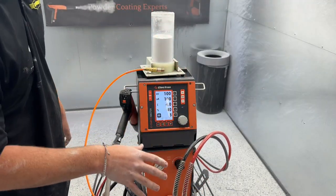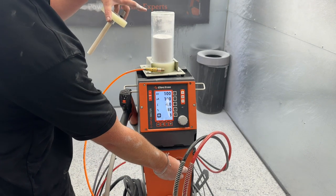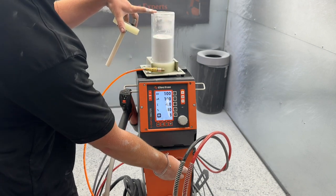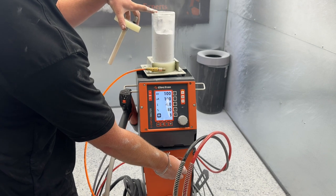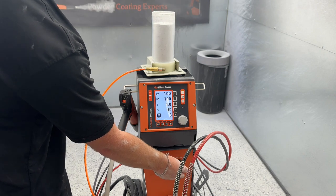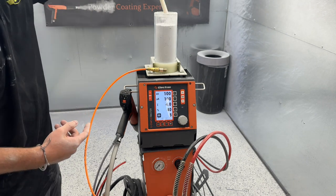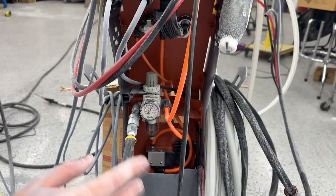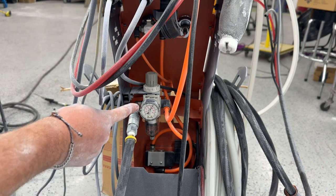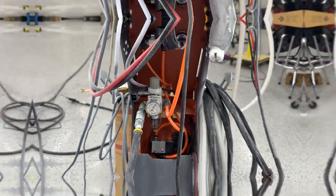Whether you're using a small hopper or a big 50-pound hopper, the same rules apply — turn it on and slowly increase your air. Small hoppers are a little more finicky, so you may have to shake it up a little to prevent it from throwing all your powder out at once. Bigger hoppers, that doesn't really happen. When your hopper looks good, go ahead and put your lid on and you're ready. One other major setting on your control unit is this main air filter regulator back here. I recommend between 80 to 100 PSI — I'm at about 90 right now. This way I have no spitting, surging, or any issues like that.